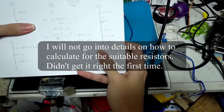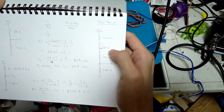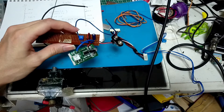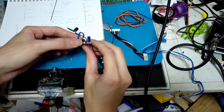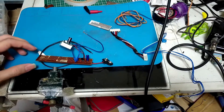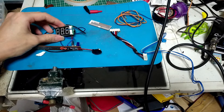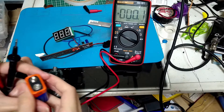So I've come up with this new design. As you can see, the only additional components are the 560k and 1 megaohm resistor. I've done the modification already but haven't completed the build yet. This is the voltage regulator — I won't go into detail on how to build one as there are tons of tutorials available. I also soldered a wire to bypass the trim pot to show you the voltage display.